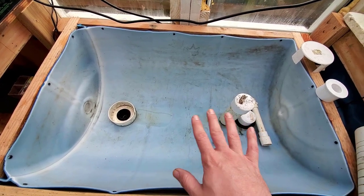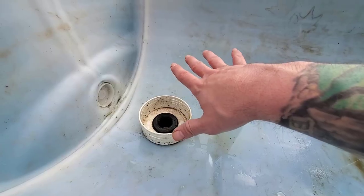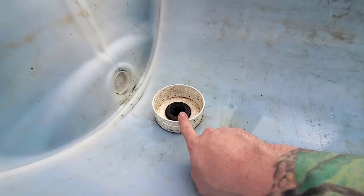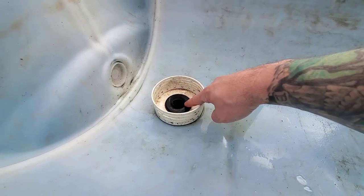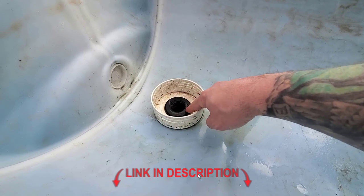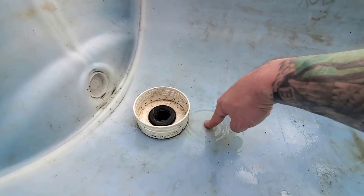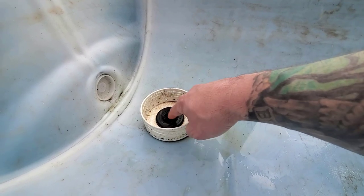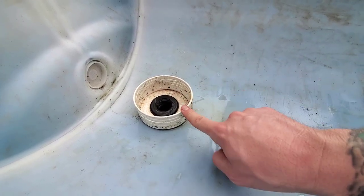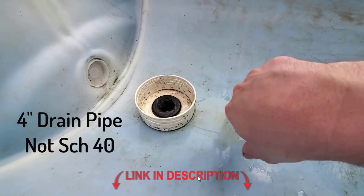For any additional new builds - I have a barrel split and framed just like all of my other videos - but this is critical. Here is a one-inch bulkhead fitting. We're not doing uniseal here, this is a bulkhead fitting because we need this thread inside here. You're drilling through this barrel for that one-inch bulkhead fitting - whatever size to clear for this, you're going to drill through here. This piece is a cap for a four-inch pipe. This is crucial to making this successful.